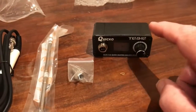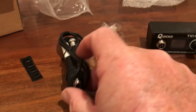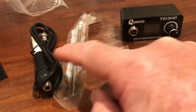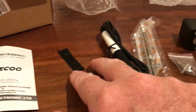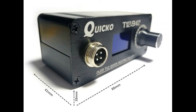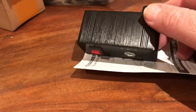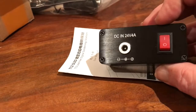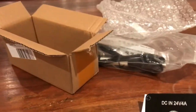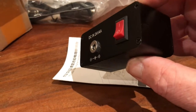These are the parts that were in the box: the guts of it — that's the soldering iron itself, that's the tip for the soldering iron, this is the nut that holds the tip inside the iron, those are some rubber feet and a little manual. I'm going to open up this little box and show you what's inside. It's designed to run off 24 volts, but works from 16 to 24 volts, and there's no power supply in the kit — it can run off a laptop power supply or something like that, or a battery.